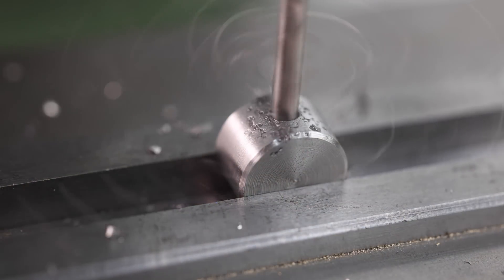Because we've got a choice of holes for the stop we can move it from one side of the vice to the other and adjust the height up and down. The real power of a vice stop is in its ability to save you time in setups. With this job here for instance I'm milling some flats on a nut that I'm making. In between each cut I'm able to remove the workpiece from the vice, rotate it, and then replace it at exactly the same position before making the next cut. If I didn't have the vice stop in place, in between each cut I'd have to remove the milling cutter, insert the edge finder, relocate the edge of the workpiece, and then swap the edge finder for the milling cutter before taking the next cut. So using the vice stop saves a huge amount of time in setup.